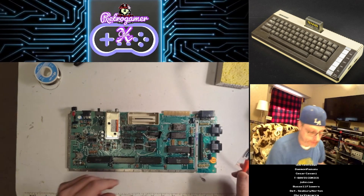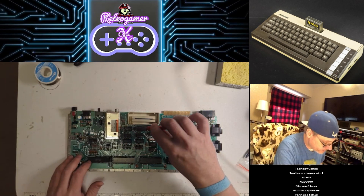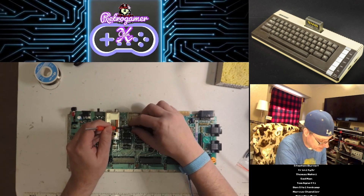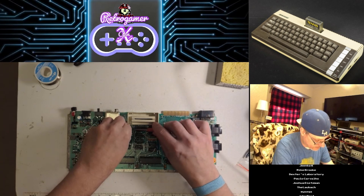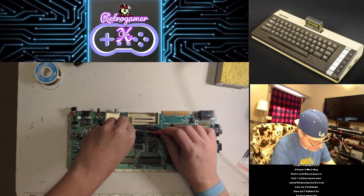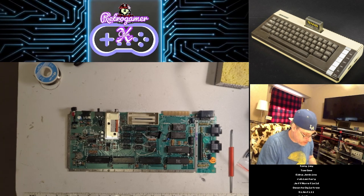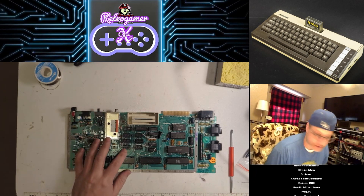The other chip we have to do here is the memory decoder chip — that one has given us some grief too. I'm going to go ahead and pull this one out now. It's a little easier to pull out but still not all that easy. Alright, there we go. I'll put it on my tray of chips here. So there are the bad sockets — let me go ahead and zoom into those sockets and show you what's going on with them.